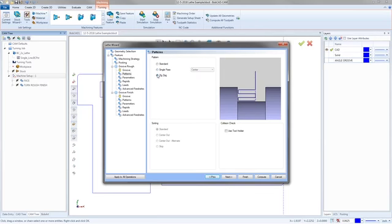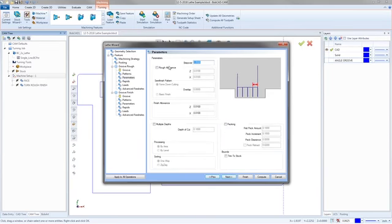You can also do a zigzag to let the tool work its way down as a zigzag. I'm going to go with standard, and for my collision checking, I'm going to just make sure my tool holder is not hitting anything, and then go next. Right here, we got our step over amount, so you can set that up to really whatever you're comfortable with. The finish allowance, or really what we're leaving for the finish pass.